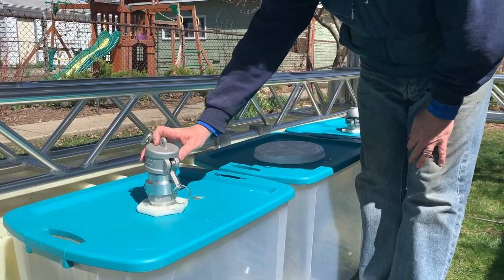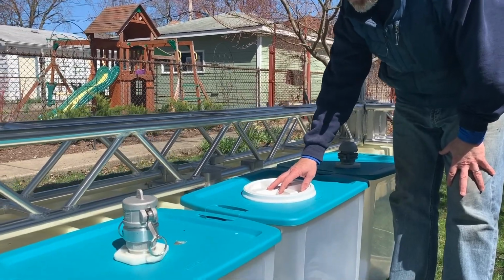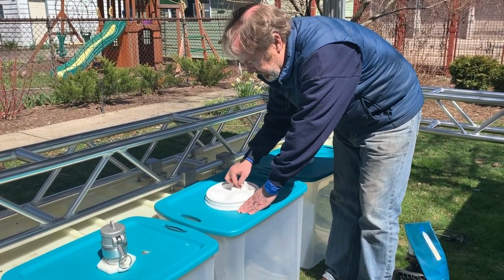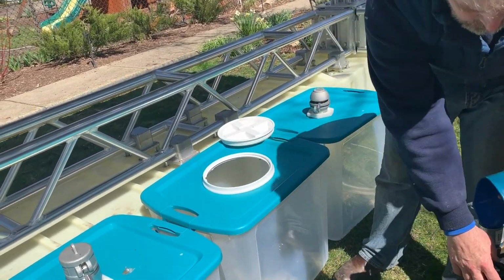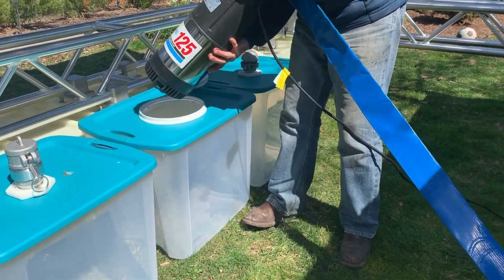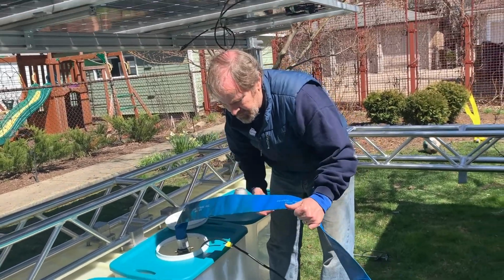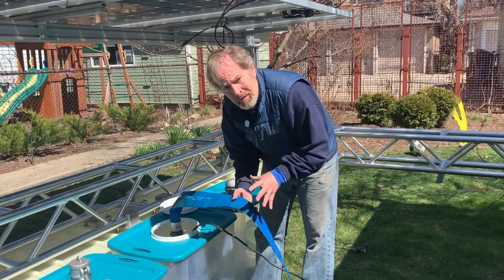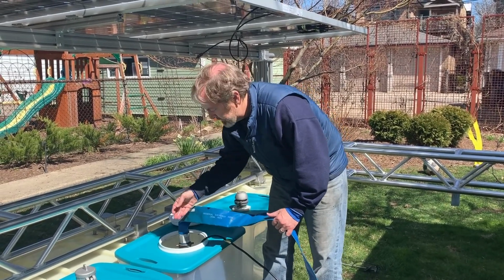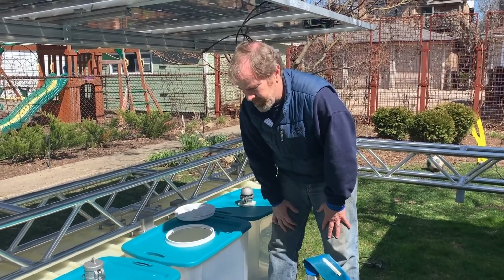The other thing we were just thinking may be worthwhile is some sort of handhold here. Originally I thought of this in case we needed to use a submersible pump, where you could have a gasketed fitting that you would just spin out and gain access to the inside of the tank, so that you could take a submersible pump like the one I have here, which is roughly 125 gallons per minute, and you can just toss it in the tank. Say if I had to evacuate the ballast to make a repair or something like that, and then at that point I can use a discharge hose, right, that's just super simple, like a ribbon that will just inflate, almost like a fire hose that you see, because that's not under negative pressure. We're not so certain that we need to do that for this purpose. It may just be practical to use the exact same pump when you relocate tanks. But this is an eventuality.